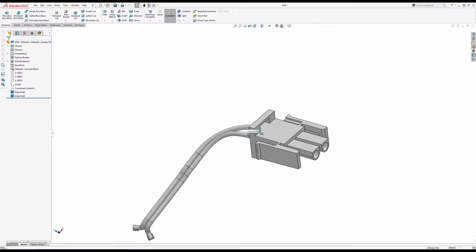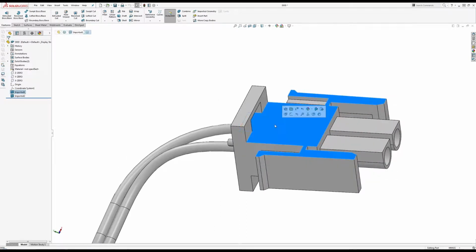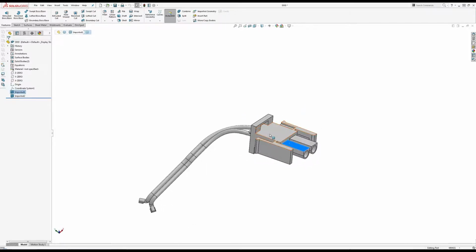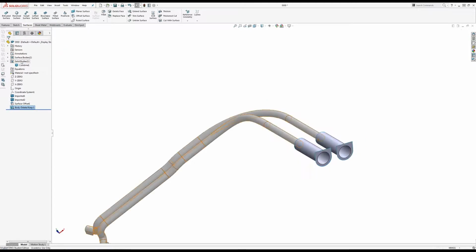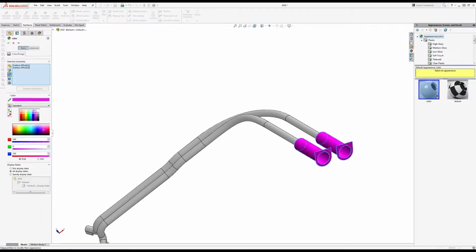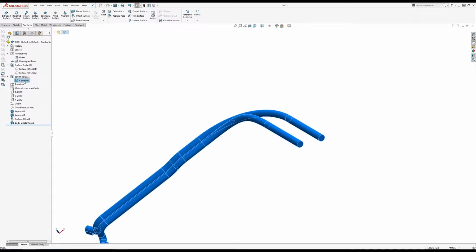Okay. Now, one little issue I just thought to mention is that if you want to keep the connector part separate for your BOM, which actually I do want to do, come to think of it, you can pick some mating surfaces. So I'm going to pick these surfaces and do an offset of 0, and then delete this solid body and set these surfaces to be pink. That's what I make all my mating surfaces that are generally hidden. That way if I see pink, I know to address it.